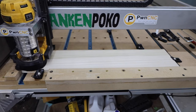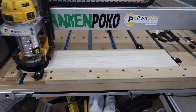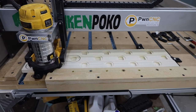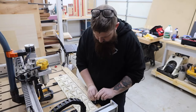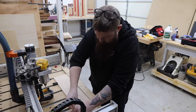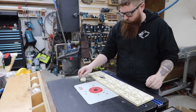This portion of the project consists of three tool paths. First it will cut a pocket for the insert, next it will make a clearance pocket, and finally it will do an outside-the-line profile cut. I've put in some tabs to keep the pieces from flying around. I was able to fit 18 of them on my material which measures five and a half by 24 inches. Now that the first piece is done, I can reset the CNC and move on to the next operation.